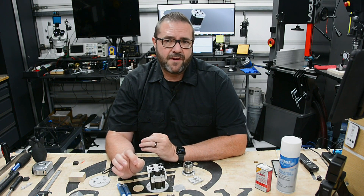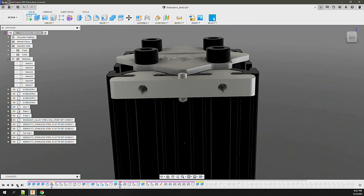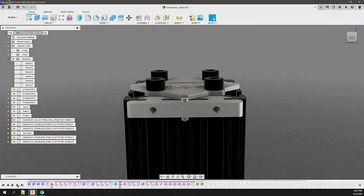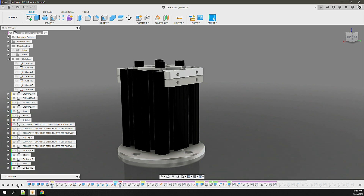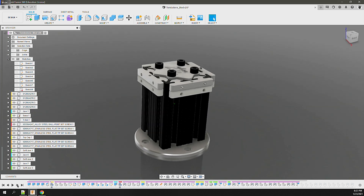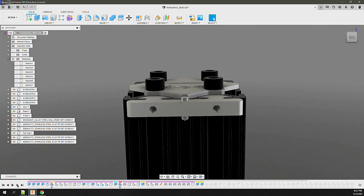The base is designed to support a 75mm piece of the extrusion. On the top side, I added another cap to seal that hollow center, and then bolt it all together with 80mm cap head screws traveling through pilot holes that are built into the extrusion. With that done, while you could use any standard T-slot nuts or fixtures on the device, I wanted to create a few super low-profile sliding jaws for the T-slots. Using the extrusion profile and adding a minimum tolerance, I created a hard and soft jaw profile. All jaws have a threaded 3mm grub screw to lock them in place, and the hard jaw also has a grub screw running parallel with the vise to push against the soft jaw and lock the stock in place.